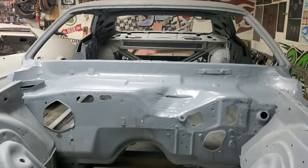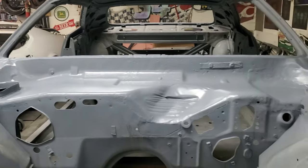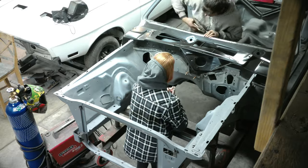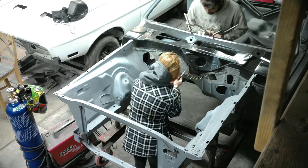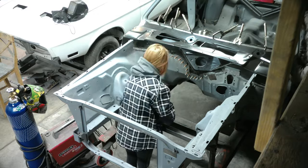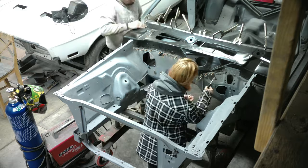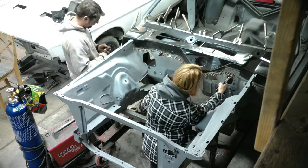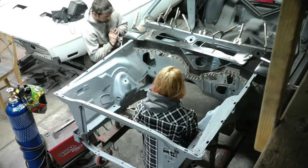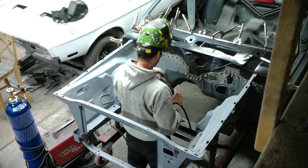My wife and I are going to put the new cowl panel on - she's helping me. It was just easier with two hands on a lot of these bigger panels. Key to a lot of these panels is clamps, clamps, clamps, vice grips - all different kinds of things to hold panels in place. We got the fasteners on the front with 1/8-inch holes holding the whole front pre-drilled. This cowl panel was already on this car - I pulled it off and put the weld-through primer on it. Everything's a lot of test fitting - put it on, pull it off. We're just clamping it down. Obviously it makes it go a lot easier as the panel is already in place, and now we start welding.